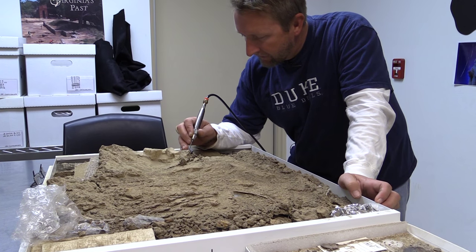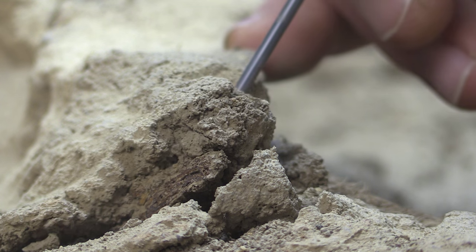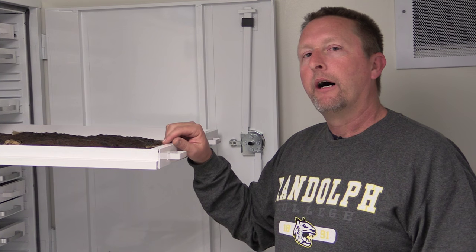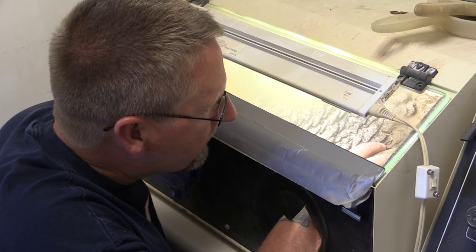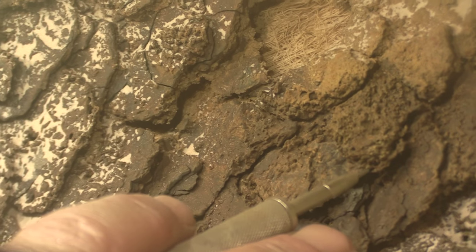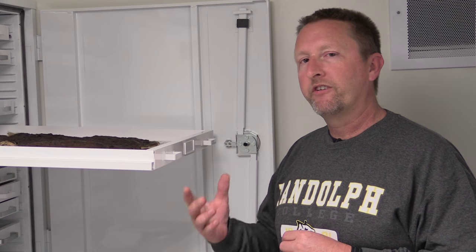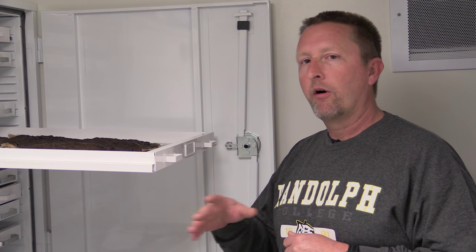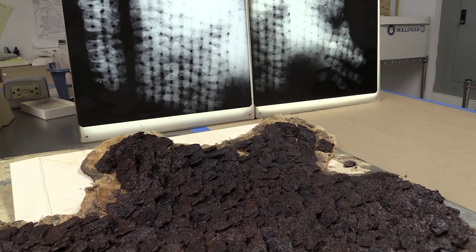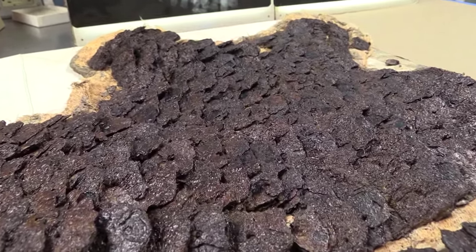Last time we talked, I was still removing some of the soil with the paleo tool. That's absolutely complete now, and after that process I put it into air abrasion — it took about two to three months in there. Air abrasion is high-pressure air pushing aluminum oxide through a small tube onto the artifact to remove the rust. Once that was done, we took it out, cleaned all the powder off, and normally we would put the artifact through a chloride removal process using deionized water.